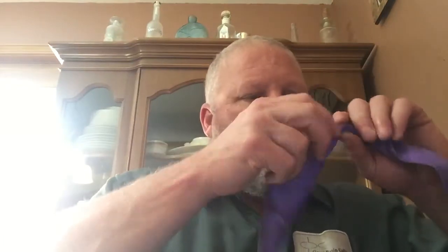They talk about protective pads, sometimes called softeners, which go around where you're wrapping the sling to keep it from getting damaged. On the last paragraph of page 4, it talks about red core warning yarns. If there's a cut in the sling and you can see the red fibers — the red cores inside — as shown in figure 7, you should not be using that sling. The saying used in industry is 'see red and you're dead.' When inspecting, if you see any of that internal red coloring, do not use it.